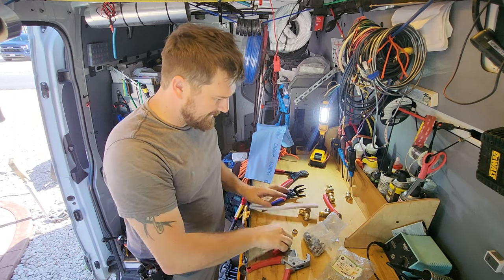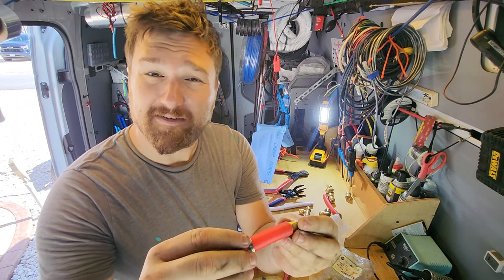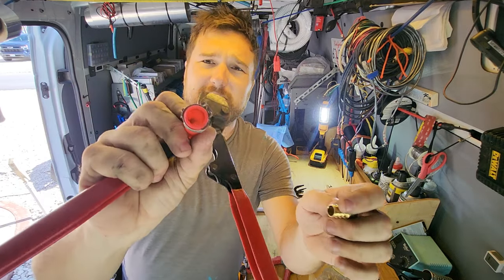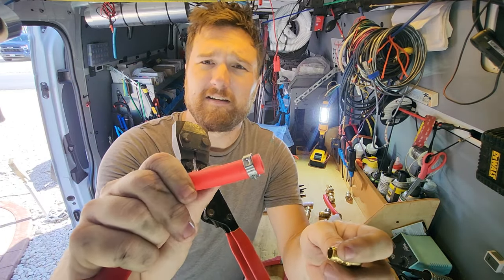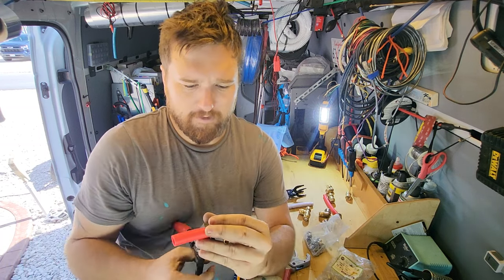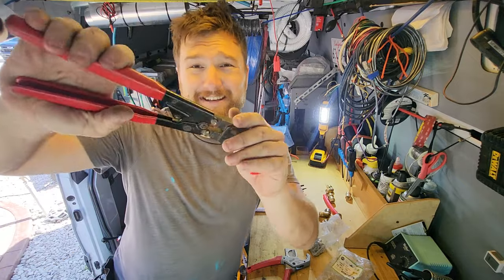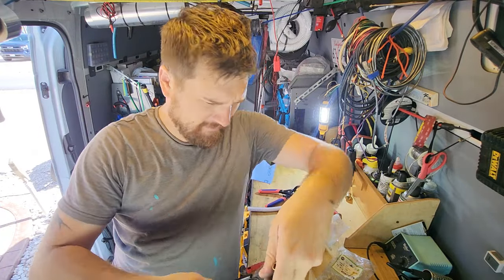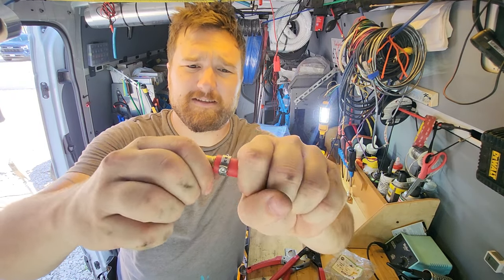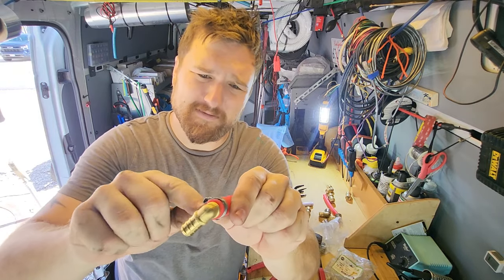I find a lot of water lines hooked up with these bow tie systems and I'll show you exactly how they install these and why I think they're not so great. So the bow tie system is this little fitting here, this little piece of metal that goes over the cover of the PEX and then they crimp it like so. This is not a very tight fit and it gets loose over time because this little piece of metal will slowly work its way apart.